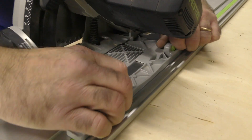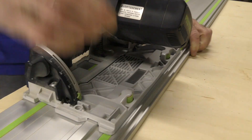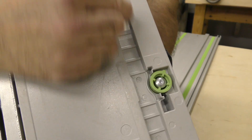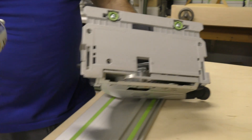As you set up your track saw, you want to take these cams — see how it's tight — and back them off so there's no lateral tolerance. But here's where I put a little bit of lubrication: you see this groove right here, and especially these cams here, and on the side here — see this little wear area.